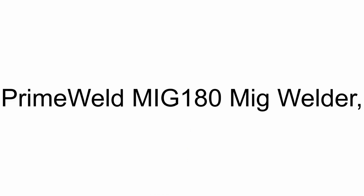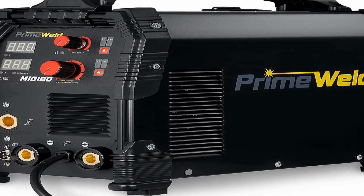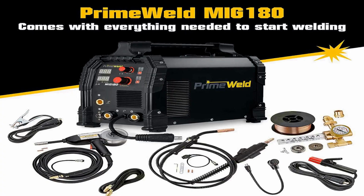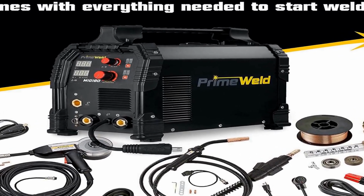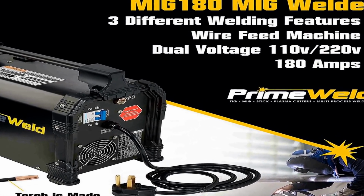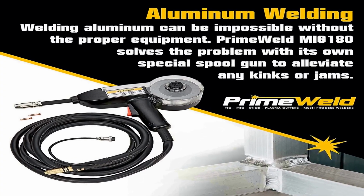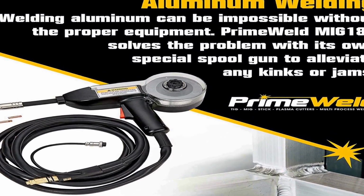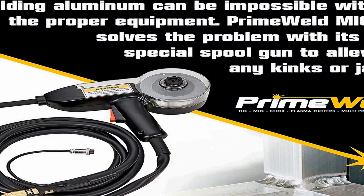The number 3 on the list is easy to use. MIG welding is easy to do with the MIG 180. With the welding machine being wire feed, most people find it easier to use than other welding methods. The MIG 180 allows you to create excellent, intricate welding designs. Amazing performance. The MIG 180 gives you 3 different welding processes. Like most MIG welders, you can run flux core wire without gas using the same equipment as you do for MIG with gas. This machine also adds aluminum welding and includes an electrode holder for stick welding.